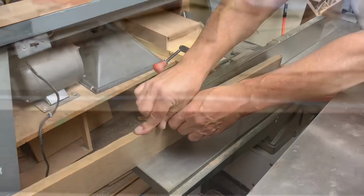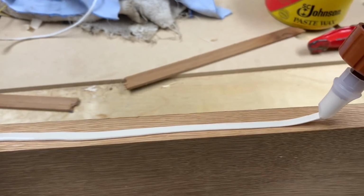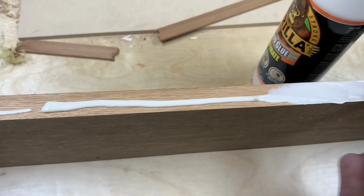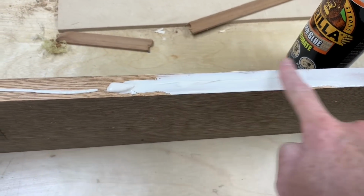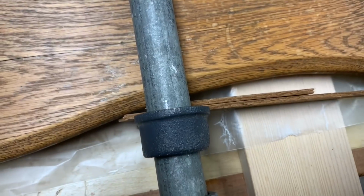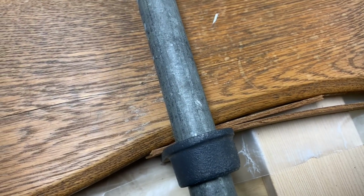That was me being excited that we finally got a flat surface. So now I can glue these back up. Again, this top isn't going to be perfect because every board was bowed, and I didn't want to send it through the planer because it'll just take away the patina and the age, and it doesn't bother me that it's not going to be exactly perfect, but it is going to be fully glued together and just a better finish overall.